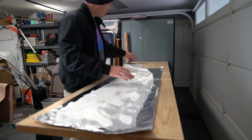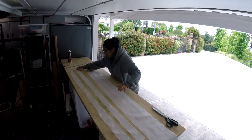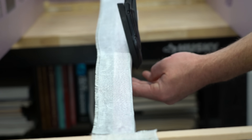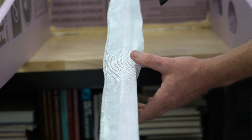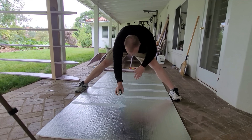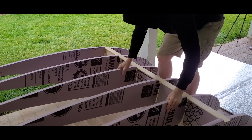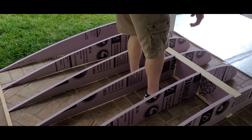After laying out some fiberglass and spraying it with 3M77, I marked some lines and cut the fiberglass into 3 inch strips. These were then ironed in place with the iron set at 100 Celsius to avoid melting the foam. In the next video I will be epoxying these to give them their strength. I haven't decided if I will fiberglass the D-Box — let me know in the comments if you think it is worth it or if the covering will be enough over the foam form. I also haven't decided on fabric or laminate for covering, and I'd like to hear your opinions on that as well.